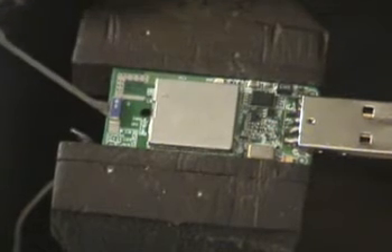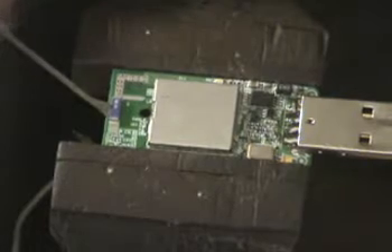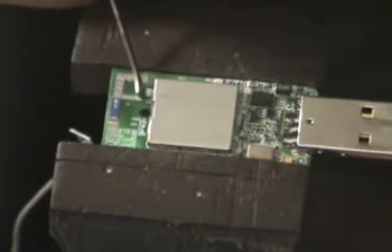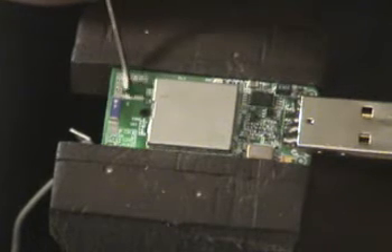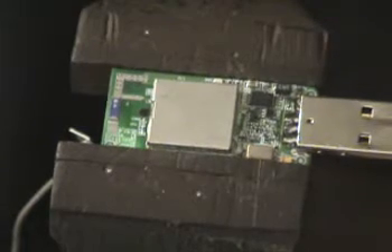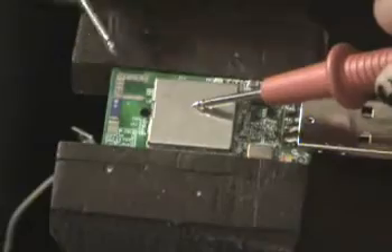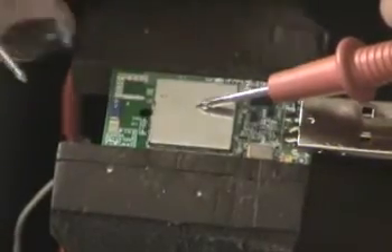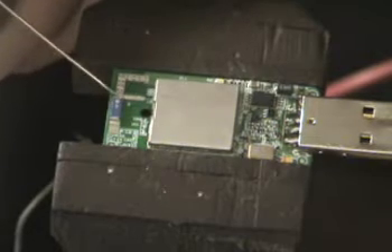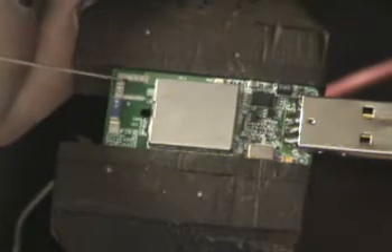Later on I'll be getting into antenna design so you can understand why this doesn't work very well. But here's a very awkward property that I've noticed a lot of manufacturers are doing. This wire coming underneath the RF shield is usually the signal wire — this is where your signal comes from. But if you notice, it loops back around to the metal shielding. And if we actually take the multimeter and put it to a continuity test, we can verify that the shield and the signal are tied together. This is not a good thing — a very bad idea. So what you have to do is first remove this component, then break away to make sure that the shield is now separated from the signal.